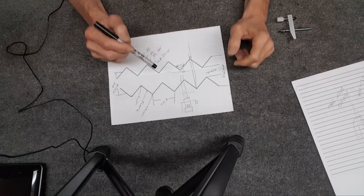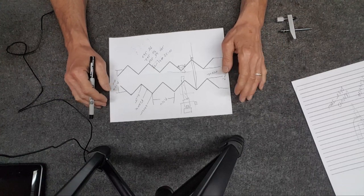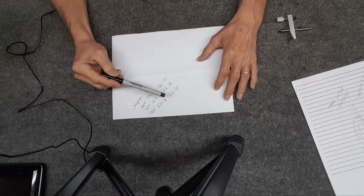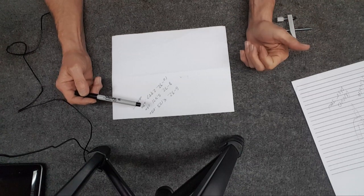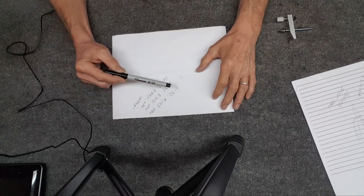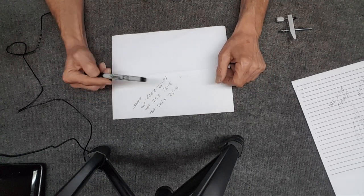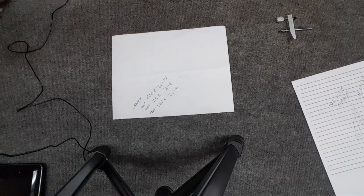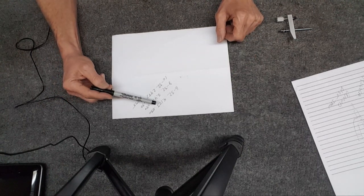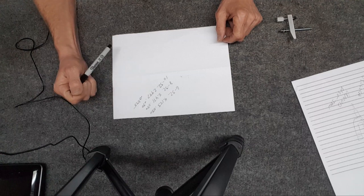One thing I forgot to mention is this right here is called the thread angle. Very complicated term to remember. But I did some playing around off camera, because I did say I didn't know whether the lathe had introduced a problem with respect to the helix angle. Three screws, they're all 32 threads per inch. I did use the calculator on the Greene Tool Systems website, entered in all of these guys, and you can see here they are all a different helix angle, 4 degrees, 3, basically. So between here and here, you've got a whole degree off.